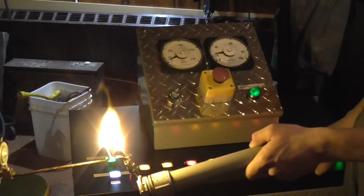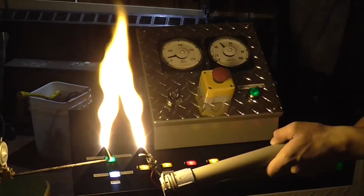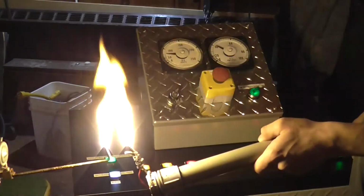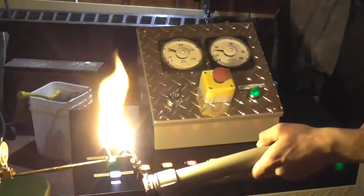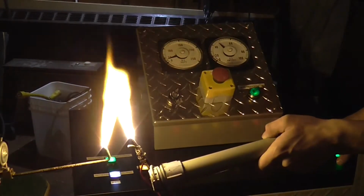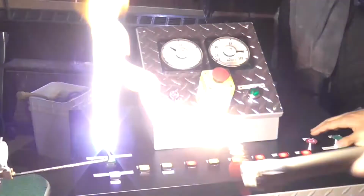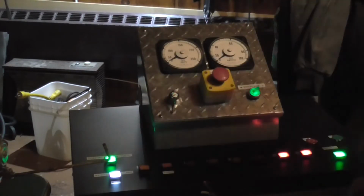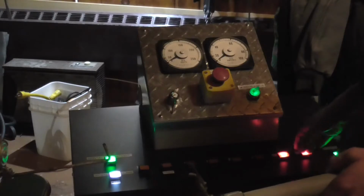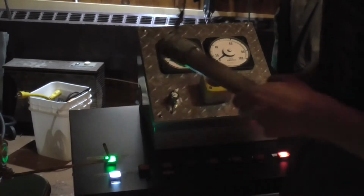Now we're going to give it the 4 kilowatts that we have in the external ballast. It's quite decent. What about bypass? Let's bypass it all. That's quite a bit. That ammeter was a bit pegged there. So, there we have the test. And I guess that showed you how this power supply works in general. So, that's our high voltage test.